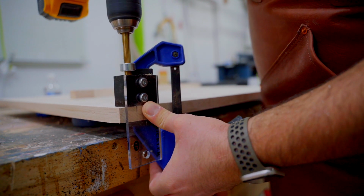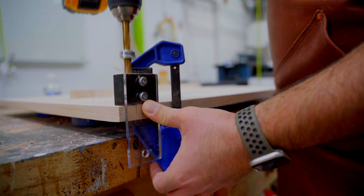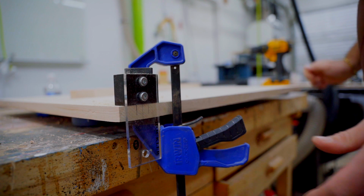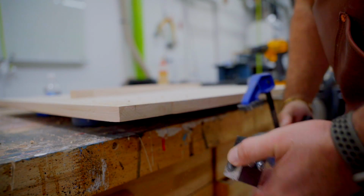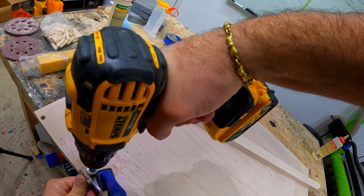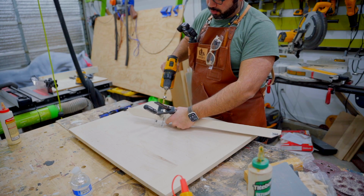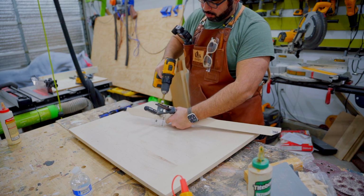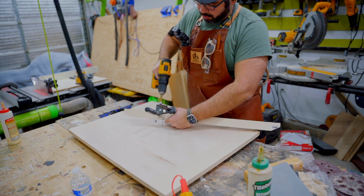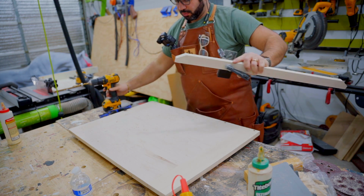Now, the challenge was to do my best to line up the indications of the dowel drill jig with my pencil marks, and every bit off at this point can compound and cause gaps or difficulty joining together the boards. So I had to eye it up and triple check my work before drilling through the jig and making the holes. I decided to spread 5 holes across each board, 1 at each edge, and then 3 remaining at an equal distance across the board to really help ensure there's alignment and strength.